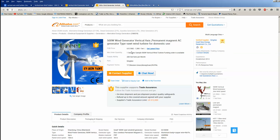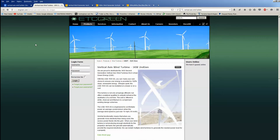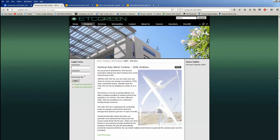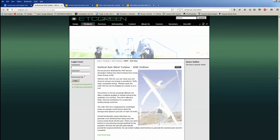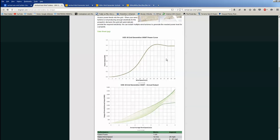Some sellers offer complete sets with the column, others sell only the generator and blades. If you look at reputable wind turbine producers — like ATC Green, Siemens, or Vestas — you find real, rated, and serious generators. For example, a vertical axis Savonius-type generator rated at one kilowatt has everything documented with charts. Looking at those charts, even the best turbines reach their rated power at around 15 meters per second wind speed, which is about 50 kilometers per hour.